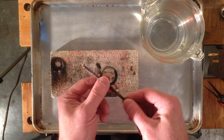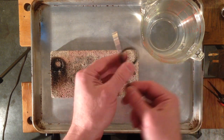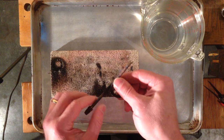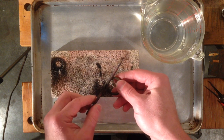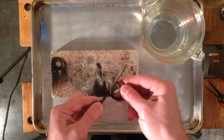Take a propane torch, heat it until it's just beginning to glow, and then quench it in cold water. Take the tip off first, I should add. Heat and quench several times. Blow some water through it until you no longer see bits of carbon coming out. That'll give you a pretty clean generator. I've done that with this, but it's still not as bright as it should be.